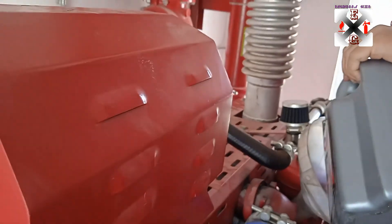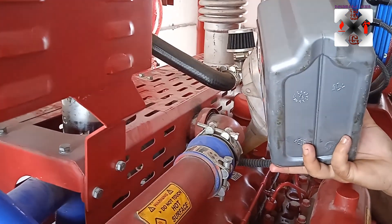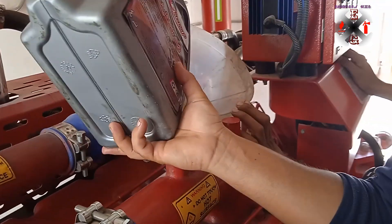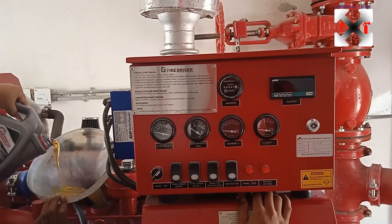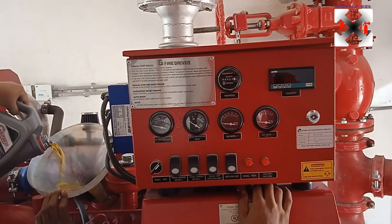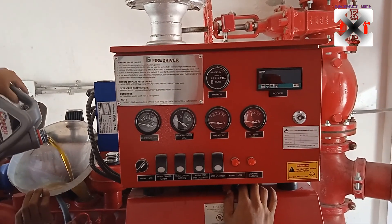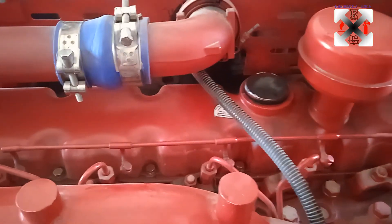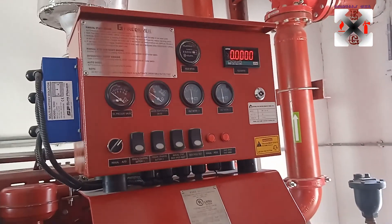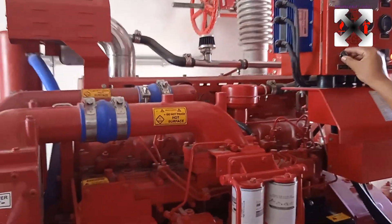Close the drain, then pour the flushing oil into the system. Make sure the filters are also fixed back in, because when you run the system the oil will circulate. For flushing, you can put the old filter back rather than the new one — because if you put the new filter in during the flush and then flush again, you could get dirt inside a new filter. So it's better to put the old one back, run the flush, then replace with a new filter.